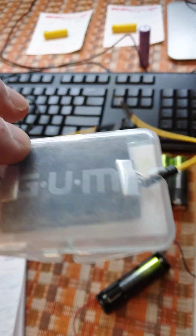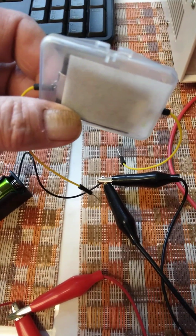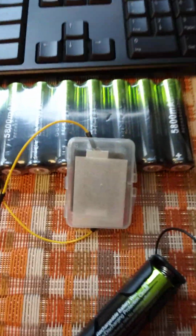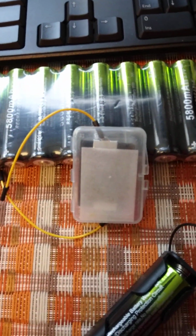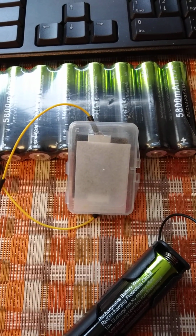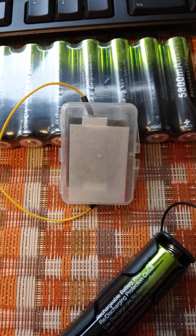So this is what it looks like. You can see the graphite sample, and we insert it right into the circuit with the negative. So it's right in the circuit with the lithium battery. And in other words, we're testing various deep-eutectic solvents with electrolytes and charging up to 4.1 volts and bringing it down to 3.0 volts to protect the lithium battery.